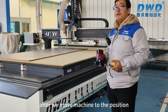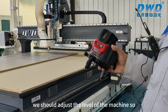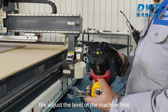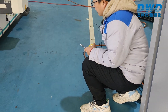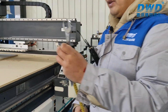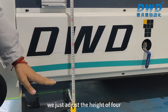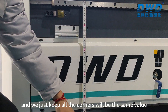After we move the machine to position, we should first adjust the level of the machine. We use a laser level to do this — switch it on and place it on the floor. Then use the tip to position it, and adjust the height at all four corners of the machine, keeping all corners at the same value.